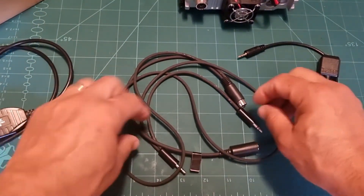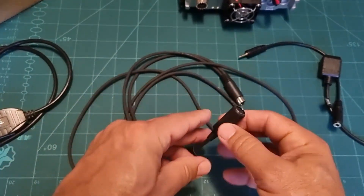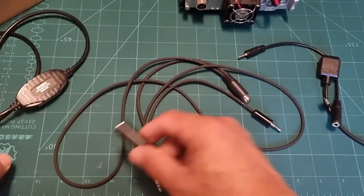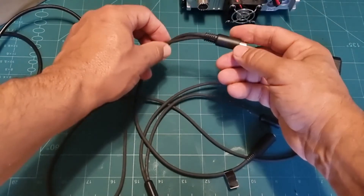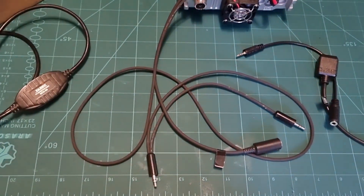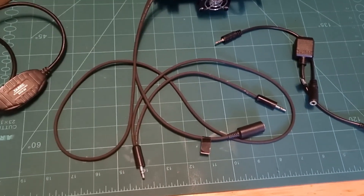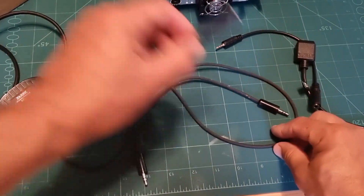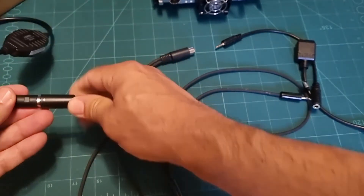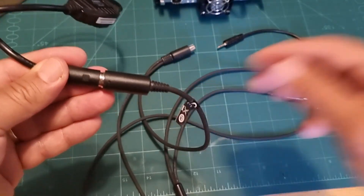If you want the full benefits, you really need the SCU 20 kit, SCU 40 kit, or SCU 58 kit. With the kit you get an additional cable which has a 10-pin connector, which connects to the SCU 20. You then connect the other end with the kit cable to the FTM radio - I've got the FTM 300. That's now connected to the SCU 20, with a bigger round dot and a square where it lines up.